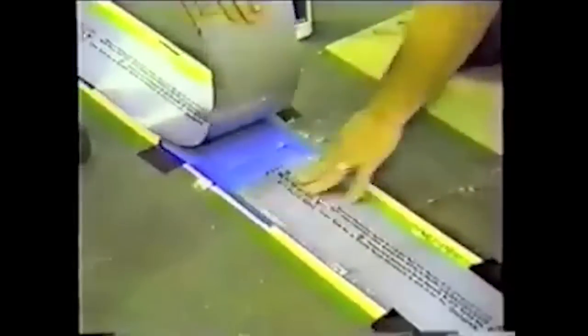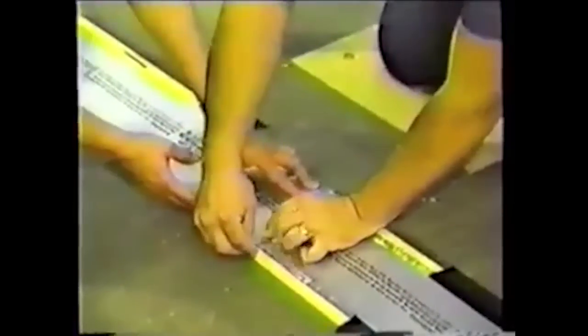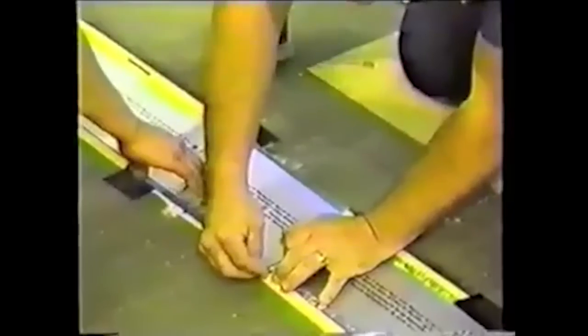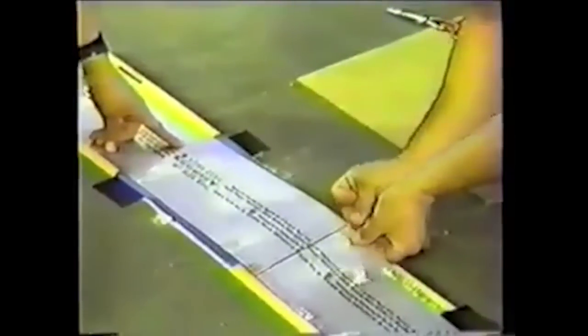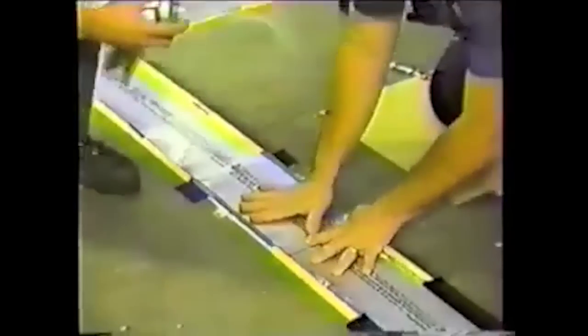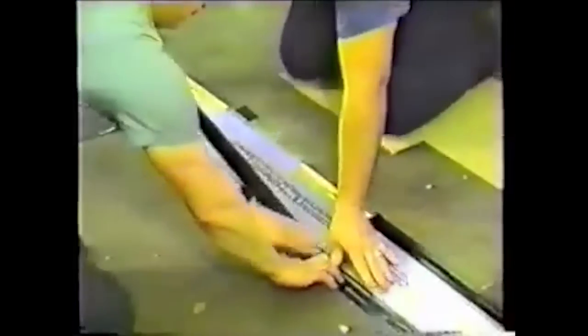Overlap and install the extended new section of top shield and 2 bonding clips per side over the extended cable installation. The top shield overlap should extend beyond the insulator patch so that the bonding clips are not installed on top of the insulator patch. Apply spray adhesive and tape the new top shield to the floor.